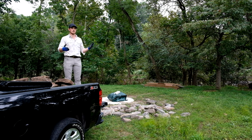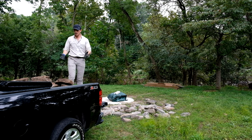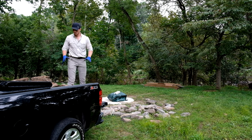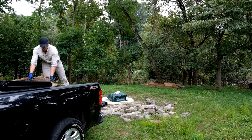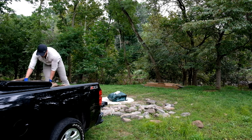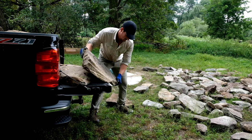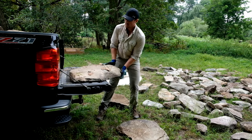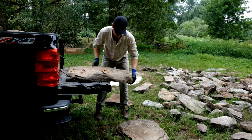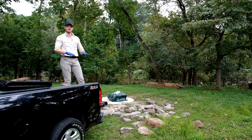The chain is only as strong as the weakest link, so we want to be sure that the foundation is nice and sturdy — hence all these really large stones that we've been collecting. The ones that are currently on the ground were actually purchased. It's called Pennsylvania Fieldstone. It's sort of pricey as far as stones or rocks go. Ideally if you're resourceful enough, you can ask around and find friends or family who might have a pile of stone in their yard. One pallet full of Pennsylvania Fieldstone is about three tons, and I'm trying to double or even triple that just to have a nice solid stone base that's nice and tall.